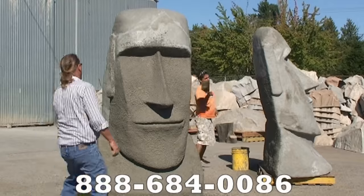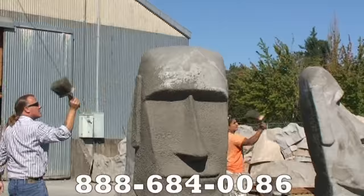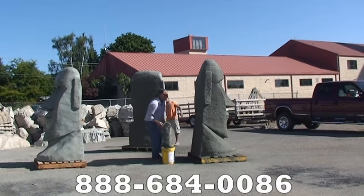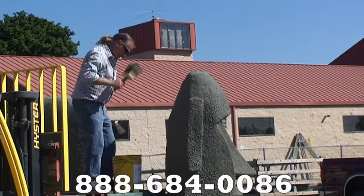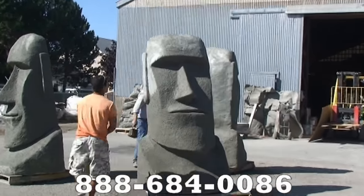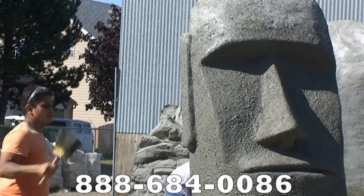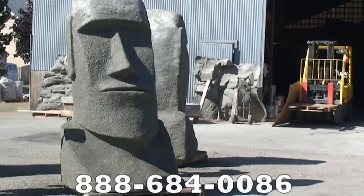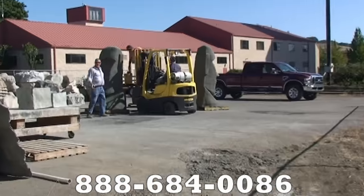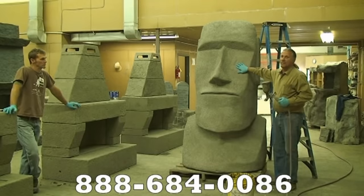The dash brush is our tool — I have a concrete pump, but my concrete pump takes about a bucket and a half of mud to fill, and this was only a three-bucket operation. The pool deck brush is my oldest form of splatter texture, and I like the effects of it more — especially not having to hear the pump, clean it, get it started, deal with plugging. Within about a half hour, the two of us had all three statues totally textured. We let it sit overnight and then came back with a fiber grinder wheel and knocked it down.